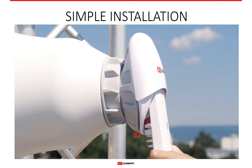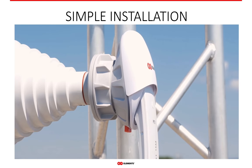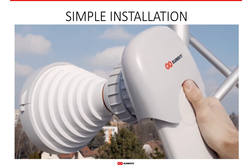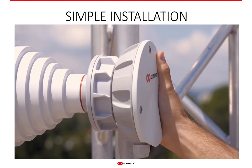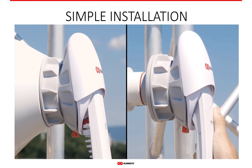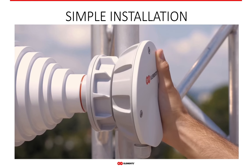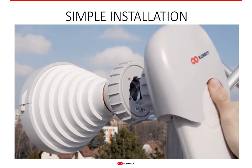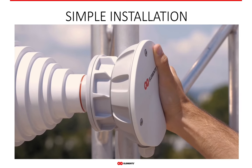The radio is installed by simply being pushed into the adapter until you hear a distinct click sound. Undeniably one of the big advantages of the Twistport environment is the simplicity of installation: insert, twist, and that's it — done with one hand. The radio is installed in a matter of a few seconds with absolutely no tools required. This is especially important for tower technicians; the less time they spend climbing the tower, the safer they are. By minimizing the time needed to install the radio, we help improve the safety conditions for tower techs.